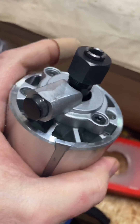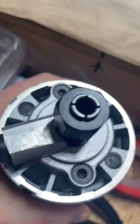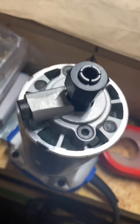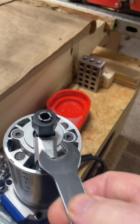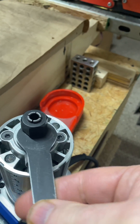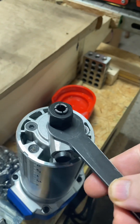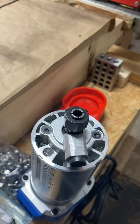So I took another one of these cobalt routers and used my bench grinder on it, and I ground the top of this round area off flat. Now my wrench can get all the way in to flat without colliding with the top of this round part.